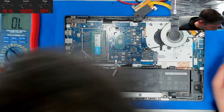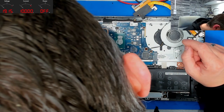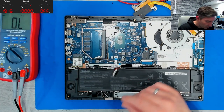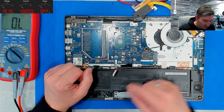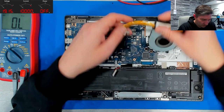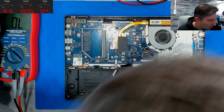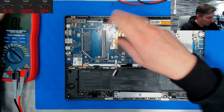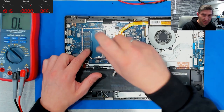Okay. So, basic troubleshooting means we have to put another RAM here. 8 GB DDR4. Maybe even without memory, because we have soldered memory here too. But then we have to put back the heatsink. So it can be even something with the memory, with the soldered memory.